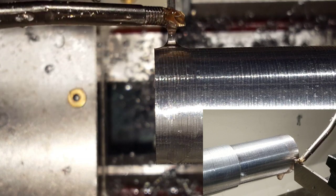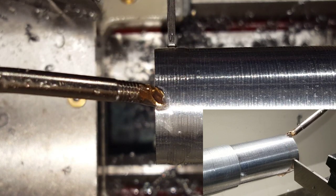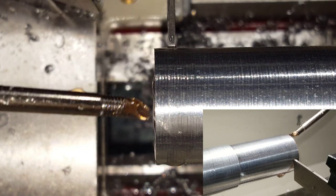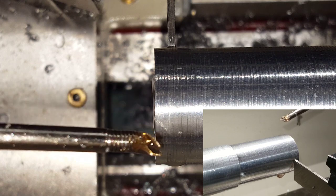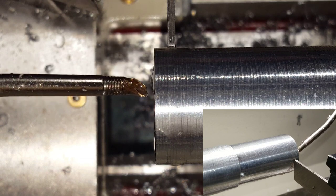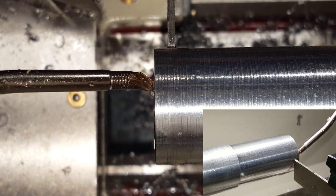Also start out with a very sharp blade and keep your speed down. For this roughly one-inch diameter workpiece I'm only going to have it around 100 RPMs. As you get closer to the center of your workpiece you can turn up the speed, because your travel speed is getting less and less anyway, so you can match the RPM to the diameter.